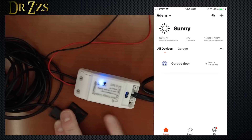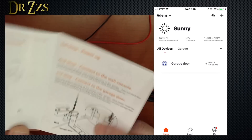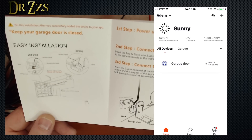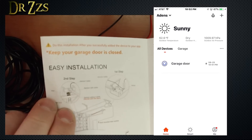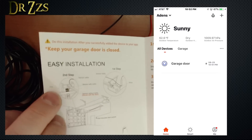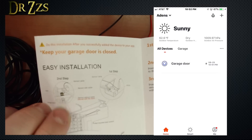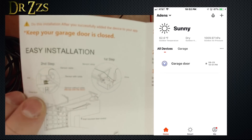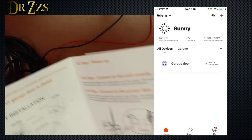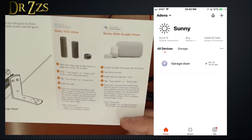The instructions are actually pretty decent — they walk you through the app and give installation guidance on where to put the sensors. They say to put the sensor at the top of the garage door in the middle. That's important because of the way the app works. If you put the sensor somewhere else, it might not function correctly — it'll open and close partway because it won't be sensing the correct state of the garage door. So mount it right at the top middle of the garage door. They give you all the hardware for that, plus instructions for connecting to Amazon Echo or Google Home.